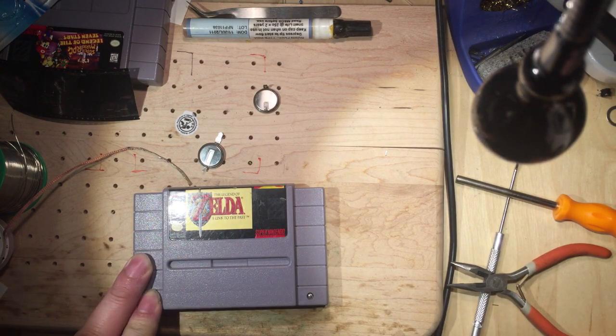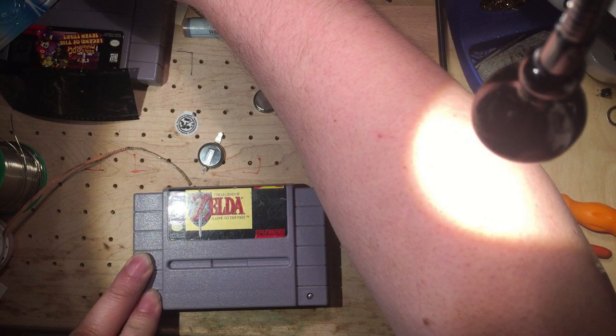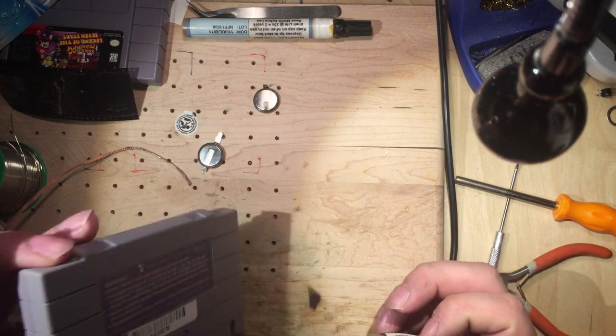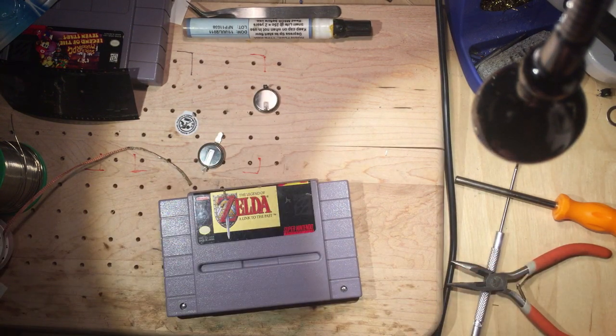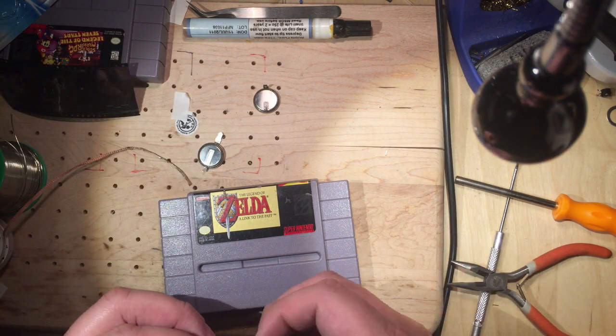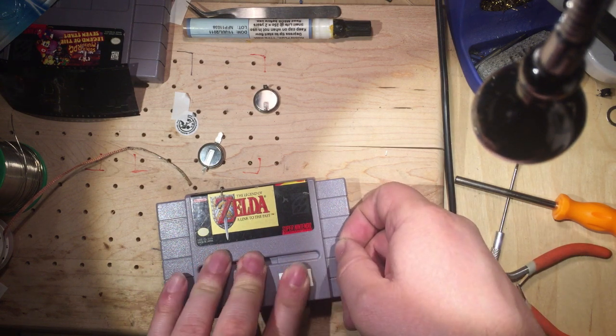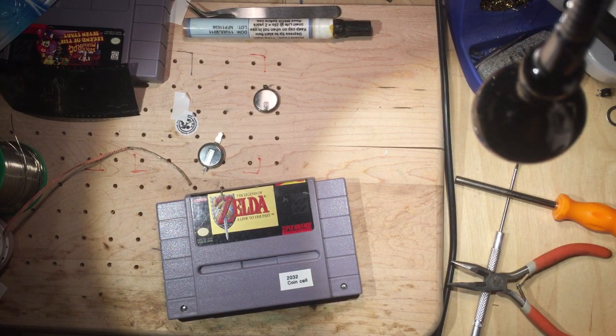When you first plug it in and turn it on, you may get some very interesting errors. Maybe even something about, you know, don't be a pirate. I forget what the exact behavior was. It was about a year ago that I did a Donkey Kong Country. Anyway, the point is that the cartridge is using a form of copy protection that is saying, hey, I was expecting something to be written into SRAM and I don't see it.